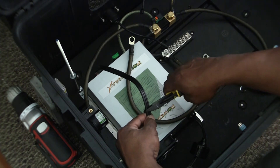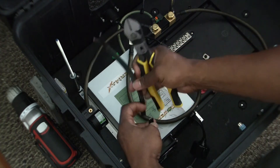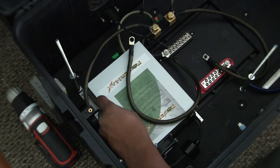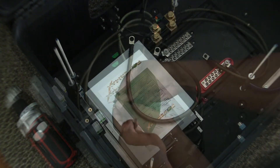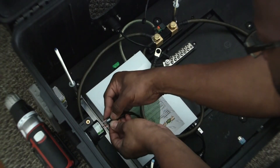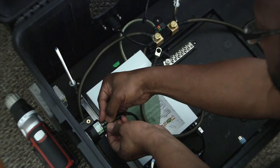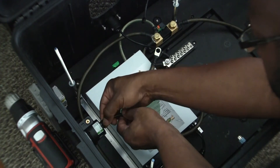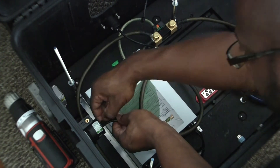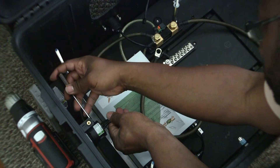This is a PowerMax power supply — it puts out about 45 amps, an awesome device as well. In the future I think I may lower this to match the output of the solar charge controller and go with a 30 amp, because then I could put in a smaller relay. Right now I have an 80 amp relay; I could use a standard 30 amp relay to switch between both devices. The reason I picked the 80 amp relay is because standard automotive relays go up to 40 max, and with these Chinese relays you want to have a little room.